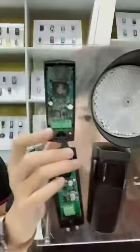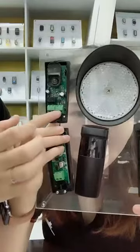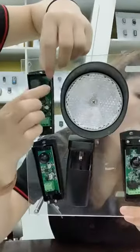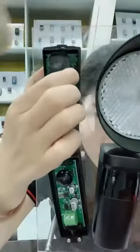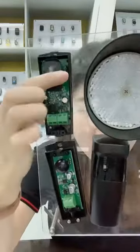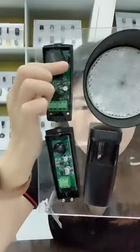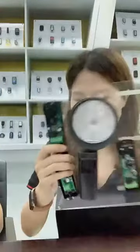About the NC or NO output: you can choose using this little jumper right here — no need to change any cables. It's convenient for you to choose normally closed or normally open directly in the cabinet.